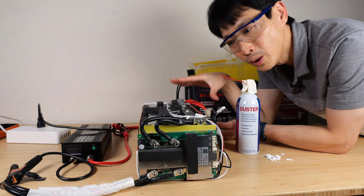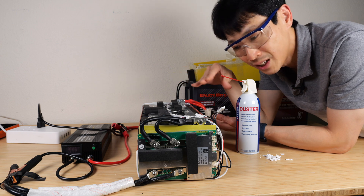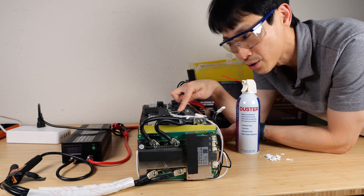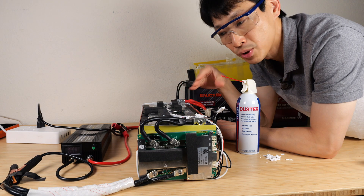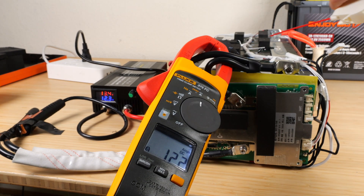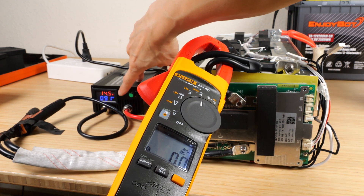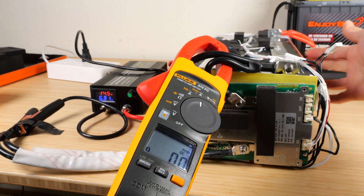This particular self-heating battery only self-heats if you are charging it. If it sits in very cold weather below 0°C it's not going to keep warming itself until it completely drains. There's one single sensor to detect if it's freezing — the bi-metal one. The heater itself uses 3 to 6 amps to heat. When using the charger you have to supply more than that current in order to actually charge the battery — they recommend at least 8 amps. When I turned on the charger and cooled it, the charger showed 6 amps going into the heating pads rather than into the battery cells.